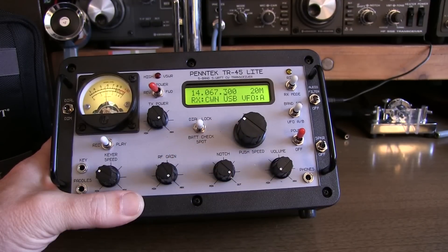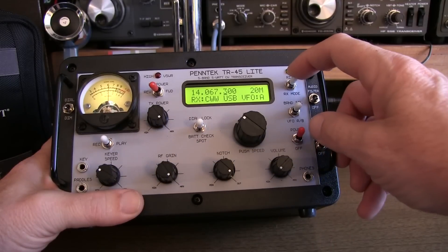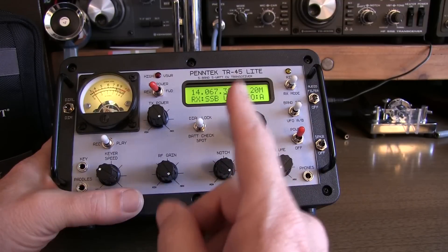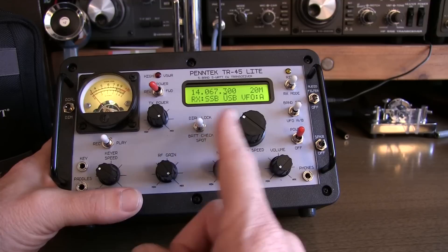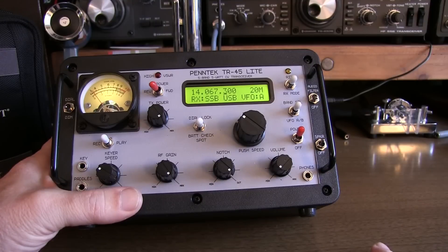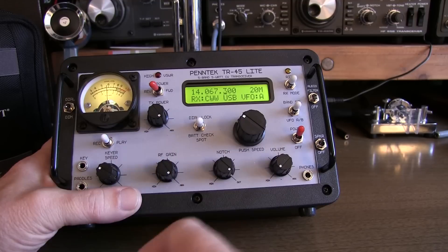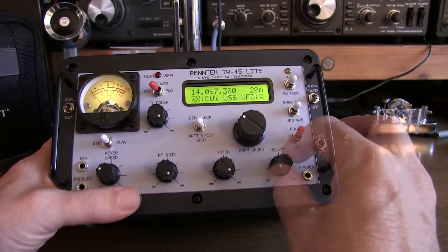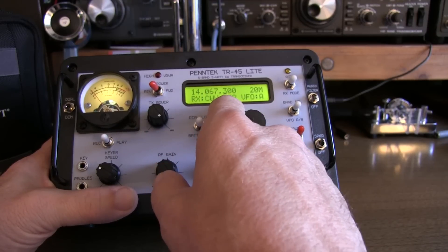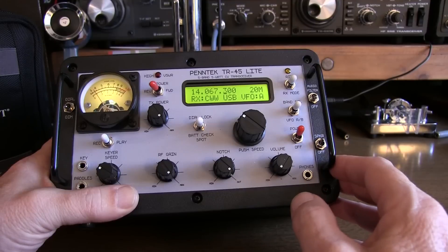There is CW narrow, which is what we're listening to now. CW wide is a wider filter position. And if you push and hold the RX mode switch down, it switches to SSB — it's the same width, but it changes the essentially zero-beat frequency, adjusting the internal LOs so that the dial frequency matches what you'd expect on an ordinary transceiver for listening to single sideband. When you're in CW mode there's a zero-beat offset so you can hear the side tone. The USB display tells you the CW mode is using upper sideband — by convention, upper sideband is used for 20 meters and up, and lower sideband for the lower bands.